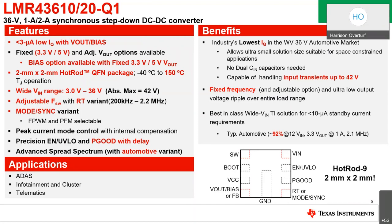Dual random spread spectrum, our latest spread spectrum technique, modulates the switching frequency in 3 different ways to minimize peak energy emissions and reduce the size of the input filter. The device also features an adjustable switching frequency from 200 kilohertz to 2.2 megahertz, allowing the design to be optimized for either higher efficiency at lower switching frequencies or a smaller solution size.